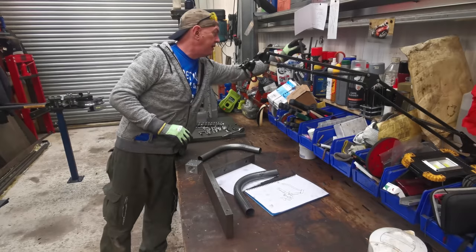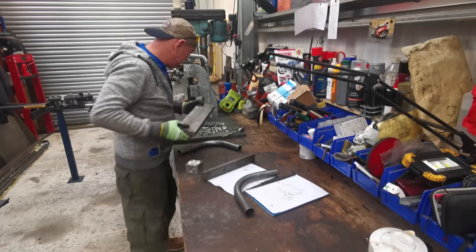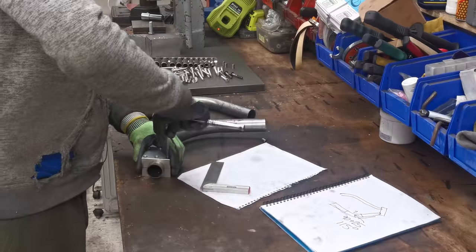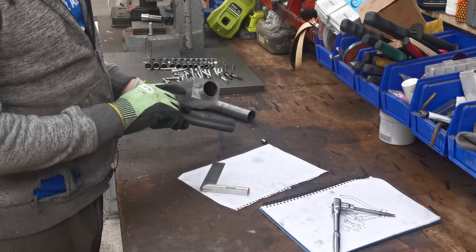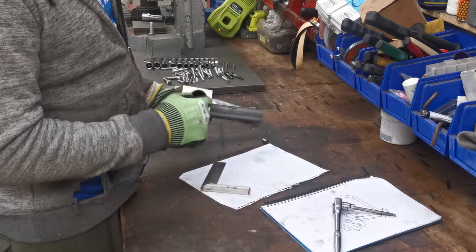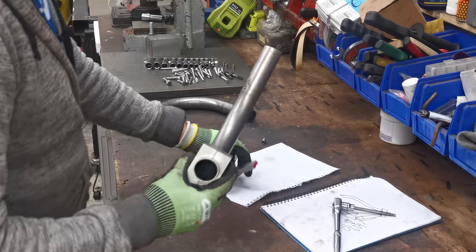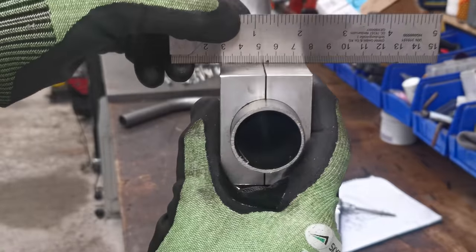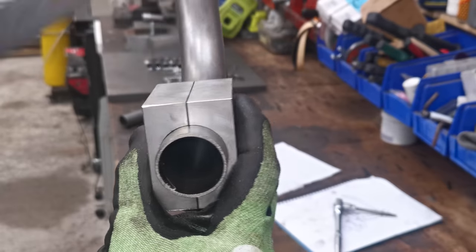I made this in the other video and a lot of people are going 'what's that for?' So I'll explain. The way this was made was I had a shim in here - some of that half mil plastic shim that you can get - and then I bored an inch and a half hole straight through it, took the plastic out, so this just clamps down. If you put a straight edge across it there is no gap - it is lovely and flat.